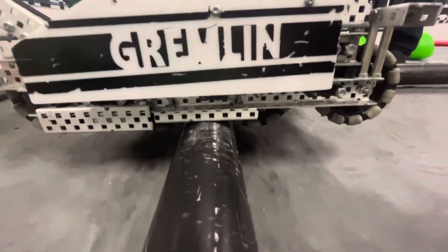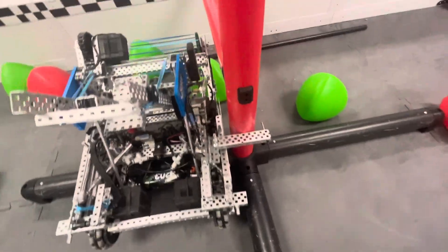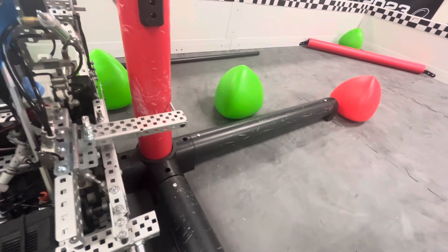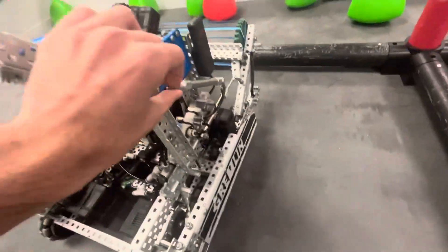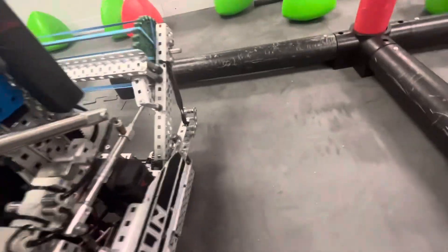You can see that it rests on the half-cuts. We found that was way better and more consistent than just resting between the wheels. That was something we saw in Ace's robot. The hook screw is just to help it not fall off as easily — sometimes it actually rests on the screw, but it doesn't really matter either way because we have a lot of tolerance since the robot is very well balanced. The biggest problem was making sure the robot didn't jump to the side when going up, and that's what these C-channels help for.